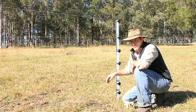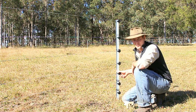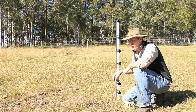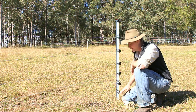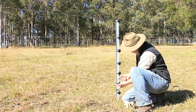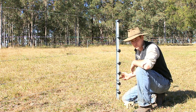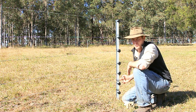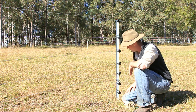For a lot of people that are just going to be running some steers or some cattle, four wires is more than enough, so you're only looking at an extra $2 a post to add insulators to the holes rather than passing through the hole. It also means that if you end up with any problem where you have a post popping out of the ground and you need to add more posts in, or you end up with a damaged post because you clip it with the mulcher mower and it gets broken, it's quite easy to replace a post — you can undo the pin lock, take the wire out, pull the post out, put a new post in, and clip it all back together again.